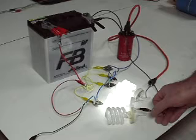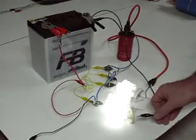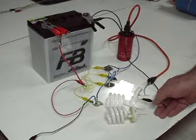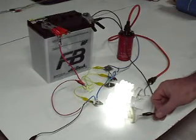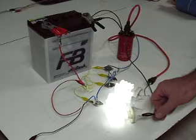These lights were blown — they did not work anymore, so it didn't cost me anything to break them up and remove all the parts. Going over to the third one — that is it. What I've noticed: when I have it on the first one, it gives me a frequency of approximately 4900 Hz. When I have two lights connected, it goes up to 5100 Hz. When I have three lights, the frequency goes to 5400 Hz — so it's approximately 300 Hz per extra light. But the drawing of electricity, when I measured it — on the amps, on the volts, as I posted on the forum — it all remains the same.